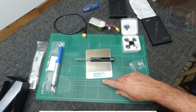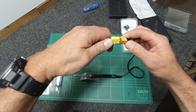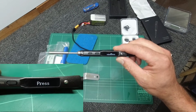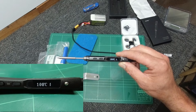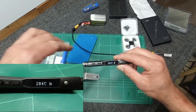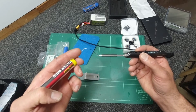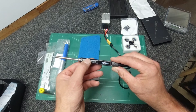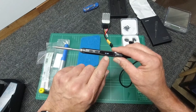On the scales: 30.57 grams. Plug in our power supply and turn it on and see just how long it takes to come up to temperature. I've fired up a 1550 4S here. It's telling us to press a button on the front, and you can see it comes up — we're sitting on around 300 degrees now, which is certainly hot enough for some solder. That was really really fast. You can long press the second button to either make it hotter or colder. If you push both buttons at once, it tells you how many volts it's actually drawing.